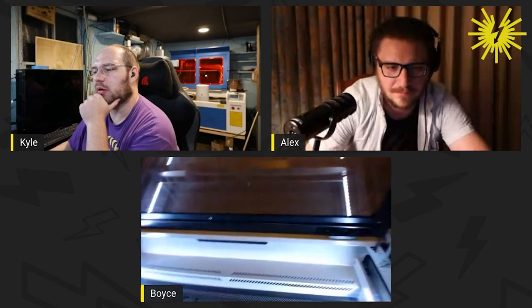To get around the safety, open up your front door and then you can close the top and just hold your hand in through the front door. Bingo. Okay. You can disable individual limit switches in your Lightburn machine settings as well. Not that we should take the time to do that right now, but that can be disabled via software. Oh, yeah. I can drop the bed down, too, to gain plenty of clearance. Duh. Yeah. Okay. Many minds. We're a hive mind. Yes, we'll figure it out. I've been meaning to do mine via software because it drives me nuts, but...